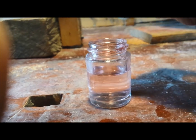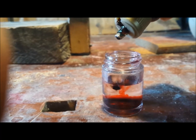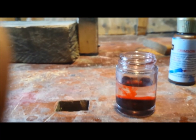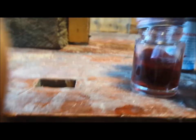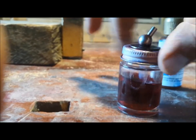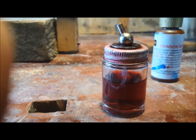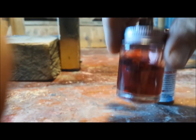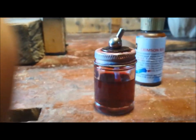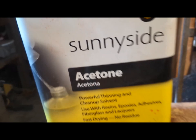That's about one ounce of acetone and I'll just put in like two drops, give it a little stir. You can leave it thin because subsequent coats only darken it, leaving more dye upon the wood — so there's no reason to go real heavy. It's a little safer to go thin anyway. I use acetone because it evaporates very quickly; I suppose really good alcohol would do the same thing.